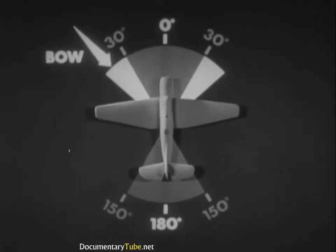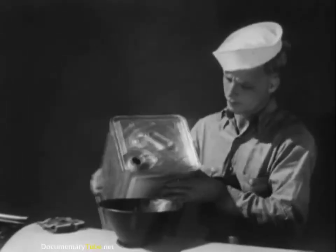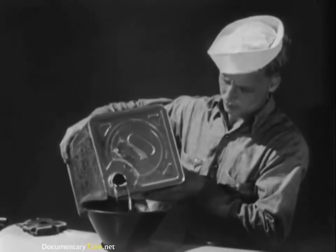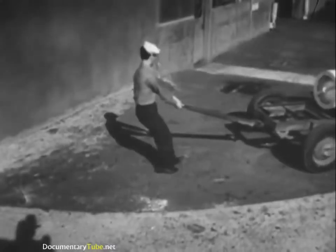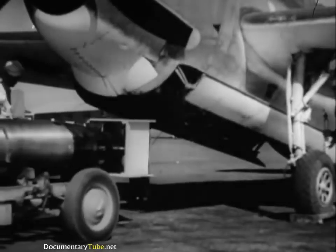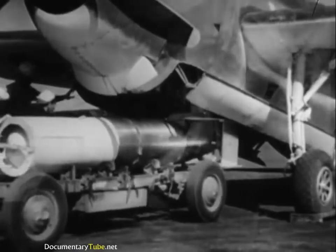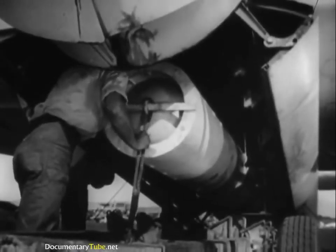At high altitudes and in cold climates, special precaution must be taken to ensure a sufficient amount of antifreeze in the water chamber of the torpedo. Buord instructions should be followed. With the new ordnance enforced, not only will the torpedo be more stable in the air and in the water, with no appreciable broaching or hooking, but initial dives in 85% of cases will be no deeper than 50 feet if the proper entrance angle is used.